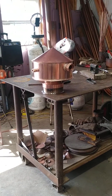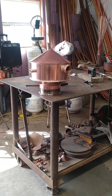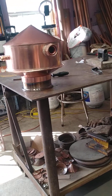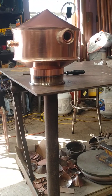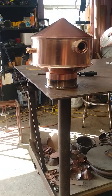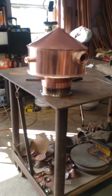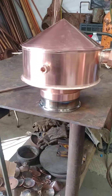I am showing you the pothead that just came out of the bath, with Eric scrubbing on it a little bit with steel wool. It's got a six-inch ferrule, stainless steel, TIG welded to a six-inch piece of pipe, that is then in turn brazed to the copper cone. The sidewall and the top are put back on by brazing with silver rod, 15% silver, using an acetylene oxygen torch. A number one tip won't get it hot enough — this is 14 gauge copper.